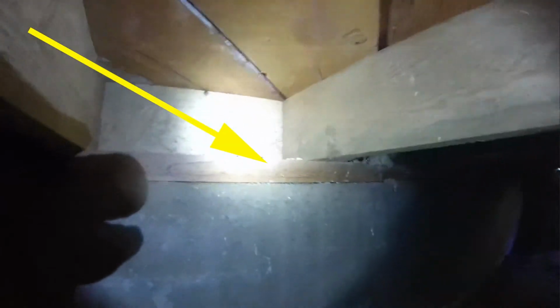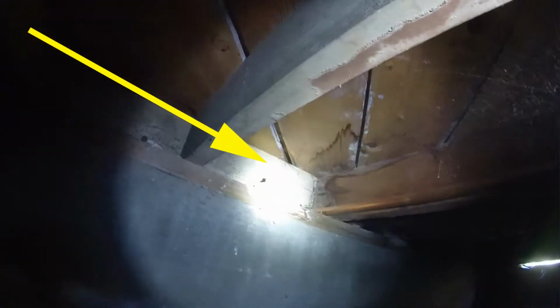Okay, so we've talked a little bit about things in and around the house. What about the actual house itself? Should people be concerned about the house just sliding right off the foundation? That's a good question. In 1946, they started requiring anchor bolts in the houses, and in 1948, they started enforcing the law. As a home inspector, if your home has a crawl space, I would be crawling under the house looking for the anchor bolts and verifying that they are there.